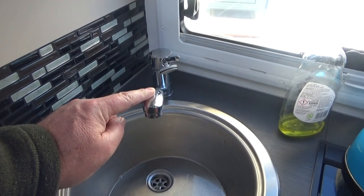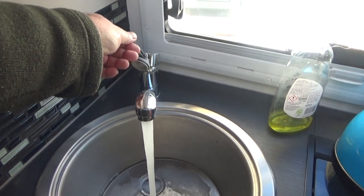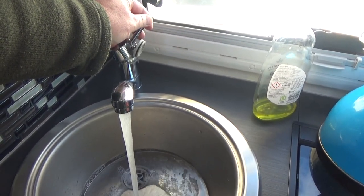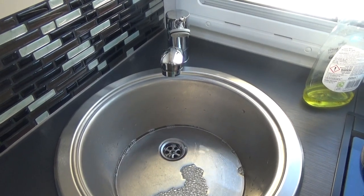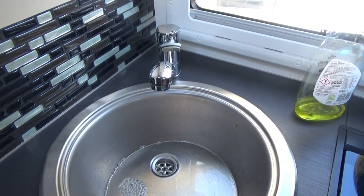We'll move to the kitchen sink now. Unfortunately I did this sink but I wasn't recording at the time, which seems a bit silly, but I do the same thing - run hot and pump through, switch off, cold, pump through, switch off, central. And then double check the pump stops. Now what we'll do is leave all that to soak for most of the day and then we'll pump it out with fresh water - now we're all primed up. I'll leave it soaking - it says between 1 and 12 hours so I figure 6 to 8 hours should be alright. And then I'll show you a bit later when I flush the system out.